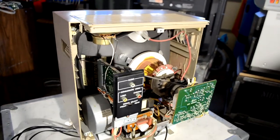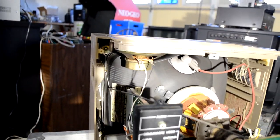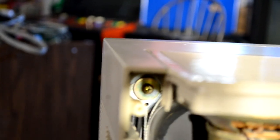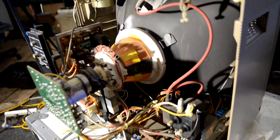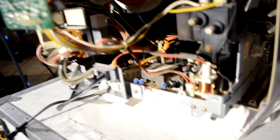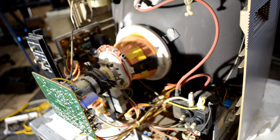Here's our first look behind the monitor. It doesn't feel very stable without the shell on, so I want to get it on its side immediately. The real problem is right there where that bolt meets the plastic — it's snapped up here and down here as well. You'll see the bolt behind that piece of metal shielding over here on the power board. Just to note, there is a Hitachi tube inside here; it's a shadow mask tube. There's a lot of dust built up in here and it just needs a good cleaning. There are some potentiometers likely for other screen geometry adjustments. We're going to move the tube so it's face down safely onto something soft.